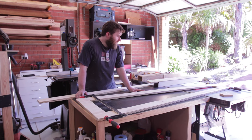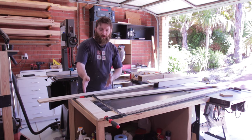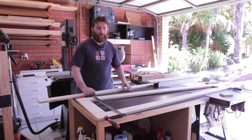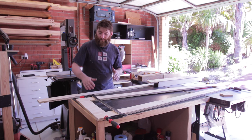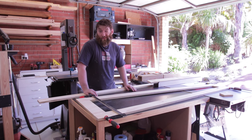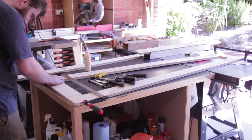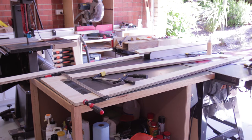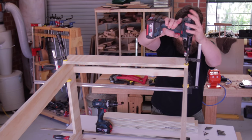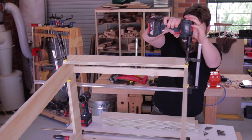This is where having a pocket hole jig would come in handy. What Norm did was build the faces first as more of a square box, then pocket hole in the stretcher pieces that go from side to side — that works because the pocket holes pull it together while the glue dries. So what I'm going to do instead is glue up the sides, which I can more easily do without the faces attached. A little bit slower, but it's hot today so it gives me a good excuse to go inside. For now I'm just screwing on the slats that the clamps will hang from — I'm not 100% certain on the best location yet since I have more clamps due for delivery. After a few weeks when I decide, I'll undo the screws, put some glue underneath, and re-screw them.